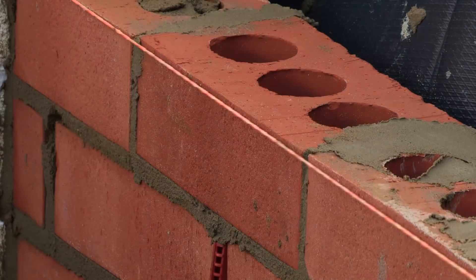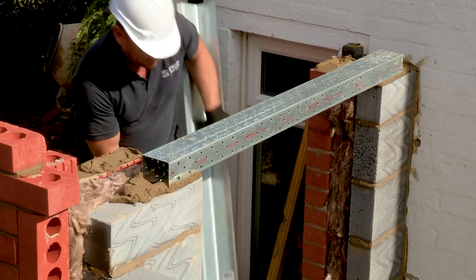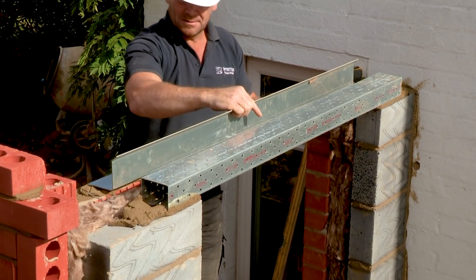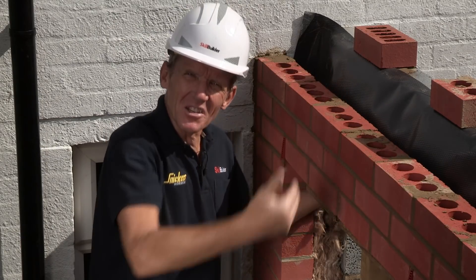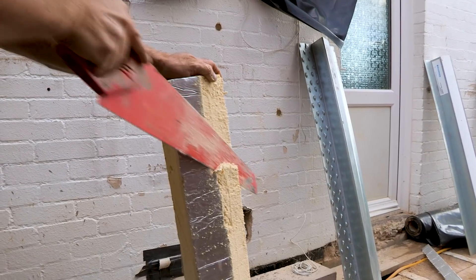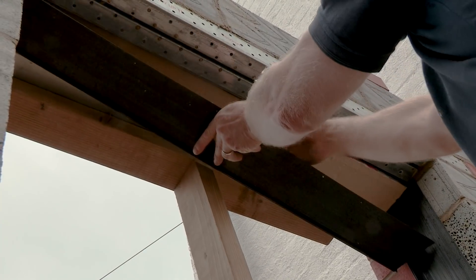Okay, so that's the two-piece lintel in place and Mark's done a pretty good job of that, but you could see that it was a little bit of a mission. Also, because the insulation is coming down at the top, we need to make sure that we continue that insulation on the side of the membrane, which means we've got to cut the piece and push it up there at the same time as we put those cavity closures in.